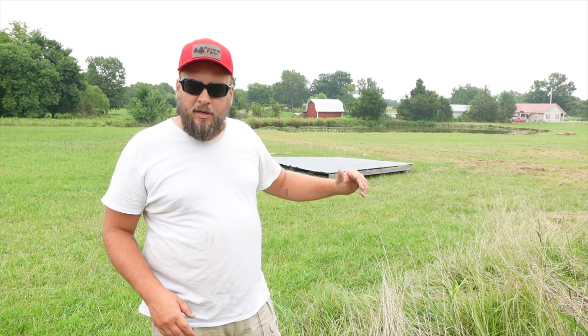Hey, it's Brock here with Rock Hill Farms. Today we're going to work on getting this property to drain into the pond as much as we can. Right now we've got some muddy areas that are low-lying, that hold water but are only 50 yards from the pond. I've got 200 foot of French drain line and we're going to run some actual drain lines that dump into the pond.